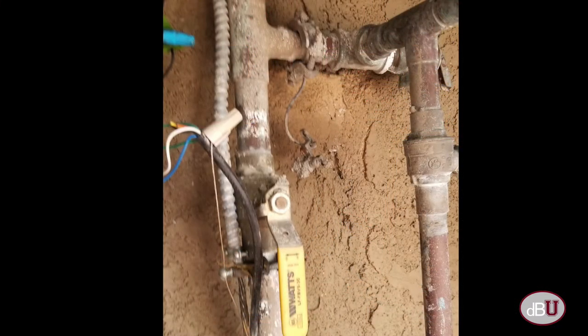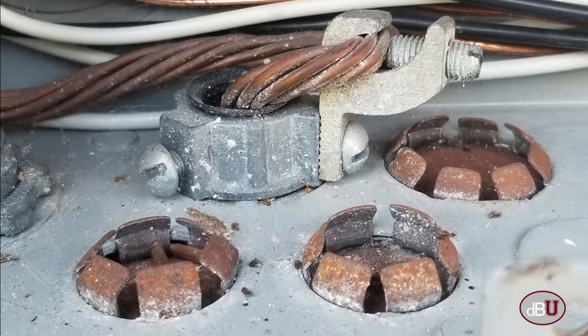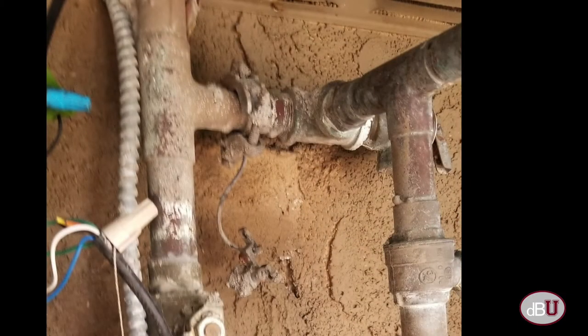As a cheap solution, he suggested I cut out a 6-foot section of my city water feed and replace it with ABS plastic. Check this out. The minute we did, my noise was gone. Why did that work? Well, people have all this noisy electronic gear at home that feeds all sorts of crap back into the ground system. Since some areas require that the electrical panel chassis be tied to the water pipe coming from the city, it effectively connects every home in the neighborhood together via their plumbing.